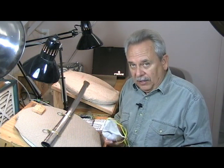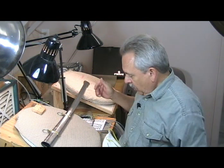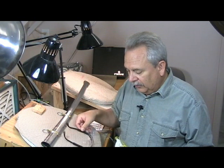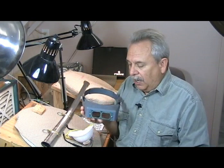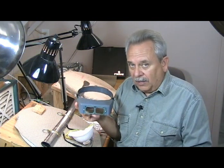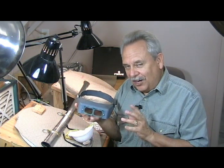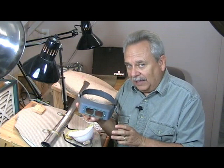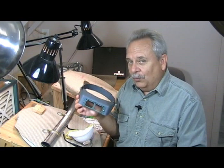You really don't want to be breathing this stuff. It grinds this metal super fine and throws it all over the place, so we don't want to breathe it and we also don't want it in our eyes. So we'll be wearing safety glasses, a respirator, and then extremely important is some magnification. This is called an Optivisor — we sell this brand. Anything that you're happy with will work, but you need magnification. Do not try to do metal work with just your bare eyes. You need magnification when you're doing this kind of work because a lot of what you're doing is little and you need to see it very well. And if you make it look good with magnification on, it'll look really good to the naked eye.